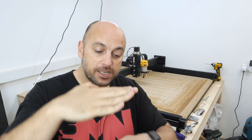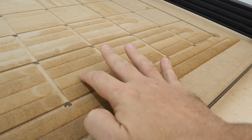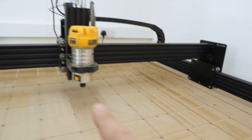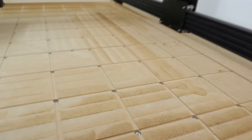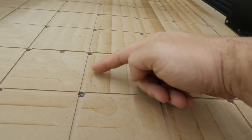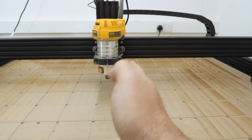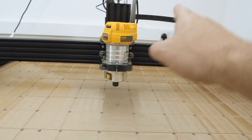In a way that actually worked out for me, because now it's time to do some tramming. For those who don't know, tramming is making sure that the spindle or router is perpendicular to the surface of the board. As you can see, there are more pronounced lines — I can feel there's a ridge, so this side is slightly higher than the other, meaning the router is tilting forward. Also going to the side, I can tell that one side is higher than the other, meaning the router is also tilting sideways — it's basically pointing toward the dark side of the moon.